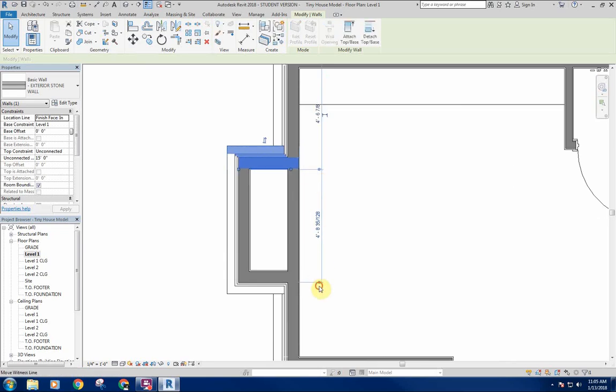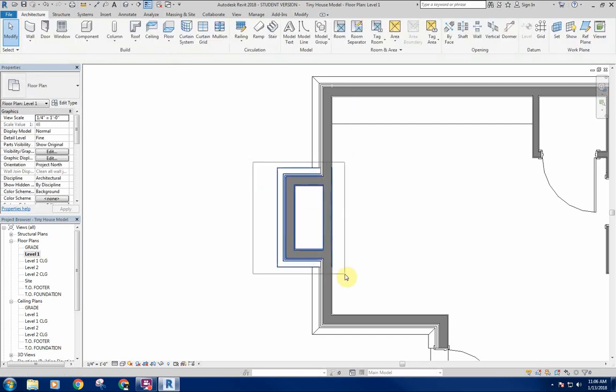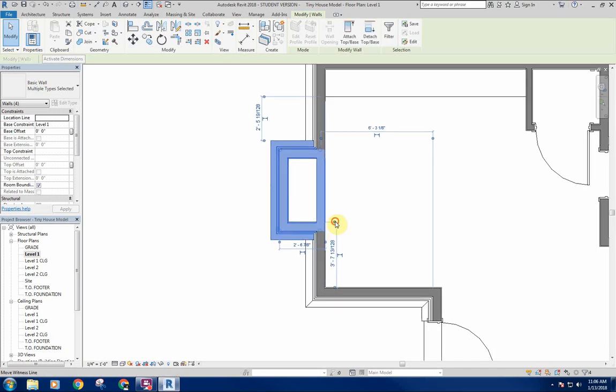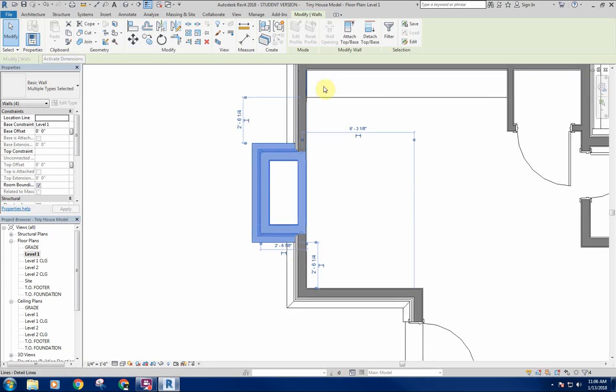And we probably won't have enough room. Let's say I end up with like a 3 foot fireplace unit in there. We'll give it a little bit of room to fit. So if we have a 3 foot fireplace unit, then we're going to want this to be evenly spaced. And you'll notice I'm grabbing these little toggles and kind of pulling them around. These I can click and it'll jump from one side of the wall to the other. That way I can kind of see where my dimensions and stuff like that are. So if I say that's 2.5, so 2'6.25" looks like the number. So 2'6.25" on either side, that centers the fireplace between my built-ins and this wall.